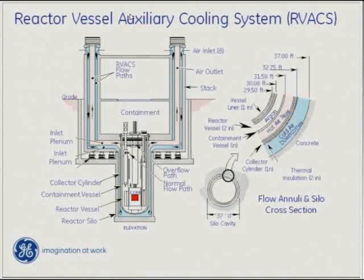When we talk as nuclear engineers to the public about transparent safety, how do you communicate that a reactor is safe? This system — you could put a little pinwheel on top, and it goes around so that anybody looking across the fence can see it's turning. That system can reject the heat; it's passive, it's always online. Analysis done on PRISM showed that with control rods fully removed, reactor pump stopped, and loss of secondary heat removal, you still will not get to a situation where you melt the fuel.